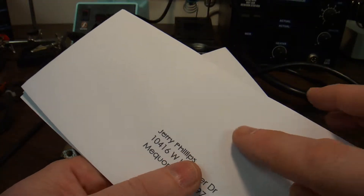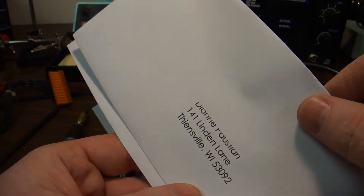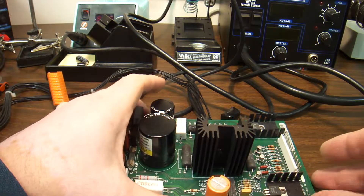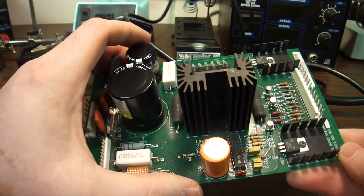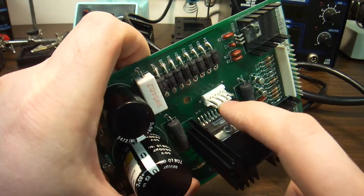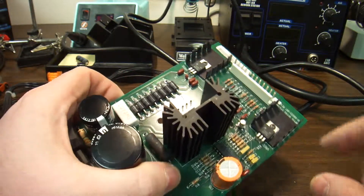You can see this one is the same, doing it on the bottom. This one has missed the top completely. As I was observing the printer, I discovered that the bottom feeder is not pulling all the way. If I helped it with my finger, like pulling it down, it would print fine. There are two chips that control the stepper motors on these printers — this one here and this one here. This is the bigger one that I think is the suspect — I think it's overheating, because sometimes it actually prints okay, especially in the beginning.